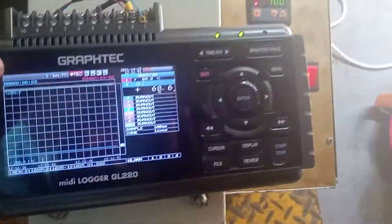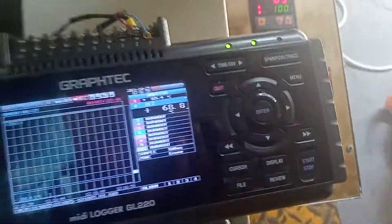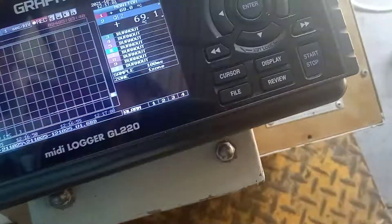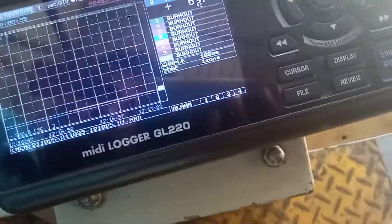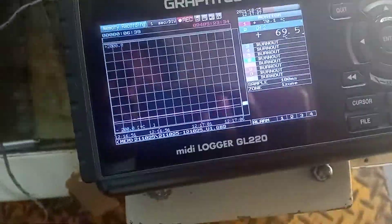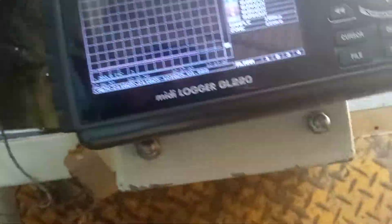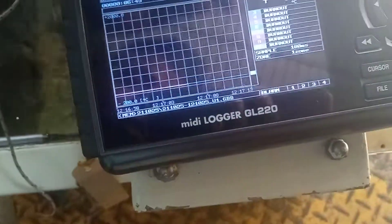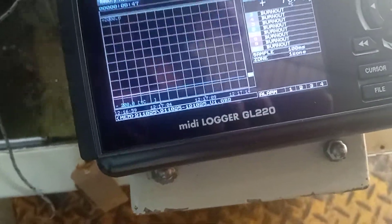This is our master equipment — this is the temperature controller, and these are two RTDs. I connected them to channel number one and channel number two. Now the controller is showing 70 degrees; this monitor shows channel one at 70.4 degrees.